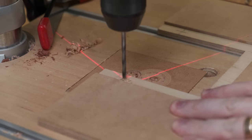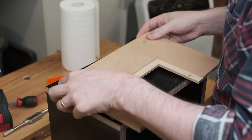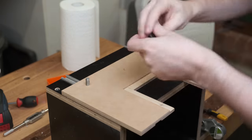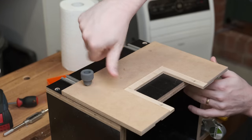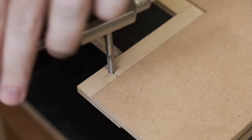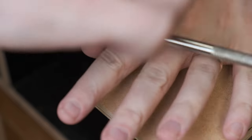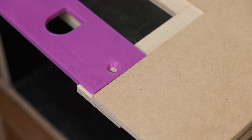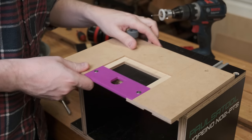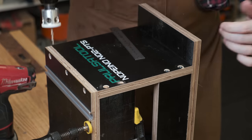This will be for the locking knobs. A smaller 4mm pilot hole is drilled for tapping later. The plywood is tapped with an M5 metal tap — this works okay in plywood, though it'd work great in acrylic. There are short threaded inserts called heat-set inserts that could be used, but I don't have any on hand. The threads allow easy swapping of templates. You can see how the T-track allows the whole top carriage to slide back and forth to adjust the template. Additional bracing is added to the front, and the clamping table will attach there too.